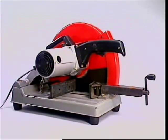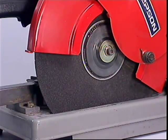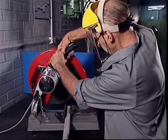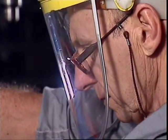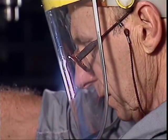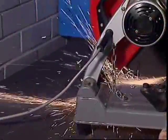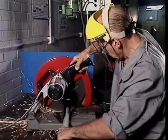Repetitive cutting through thick sections of material can be hard work unless you have an abrasive cut-off saw. These are rated in different sizes, usually from about 250 millimetres to 500 millimetres, referring to the largest diameter cutting wheel that should be fitted. This is a powerful tool and it demands every precaution: wear protective clothing with nothing hanging out or loose — especially long hair; cover long hair with a snood cap; and wear safety glasses or a full face shield. The guard on the saw should be properly in place and the power cord well away from the cutting wheel. The range of sparks should be limited by a safety screen around the job.